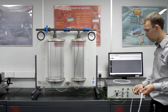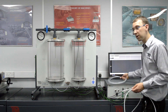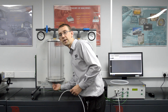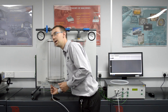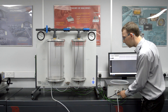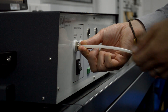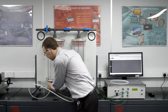To connect your air pump to one of your vessels, take one of the supply tubes. The larger tube connects the pressure port to your pressure vessel; the thinner tube connects the vacuum port to your vacuum vessel. Take your tube, push it into the socket and you'll feel it engage — if you pull it, it won't release. Take the other end and connect it to the self-sealing valve on the underside of your vessel. Push it in until you feel it engage, then give it a tug to confirm. Then all you need to do is turn the pump on to pressurise your vessel. To disengage your tube, push the little outer ring of the connector in and then pull the tube firmly. That is the same for both ends and both sides of tubing.